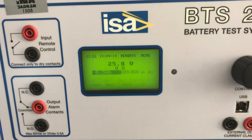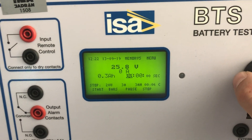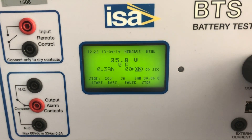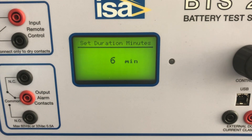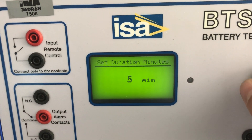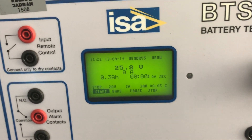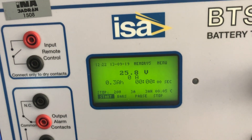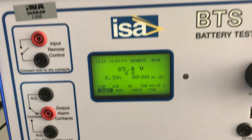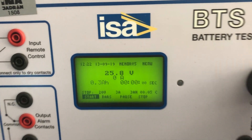You could also limit your discharge with the amount of energy which will be discharged — let's say we'll put three amp hours, even though we will not reach that because we will be discharging three amps at 25 volts. This is the important one: it tells you for how long you will be discharging. Usually we put a few hours here, but right now let's say five minutes. You can see we can just click start and have our testing.